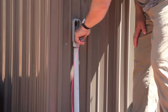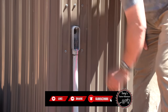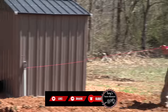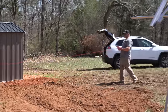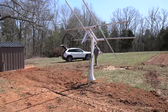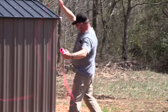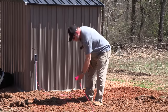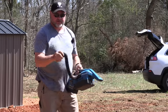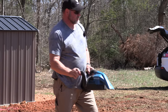Take the bag and gently try to push it into the hole without causing damage. You don't want to stuff it in there so hard that it's hard to get through. Then you need to have enough string let loose so it can pull its way across — roughly the same distance as the conduit run. Sometimes grass or little clods of dirt can cause this to hang up, so do your best to make sure there's nothing in the way. This is a battery-powered vacuum from Harbor Freight — it's got good suction, so I think it'll work.